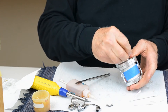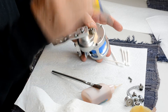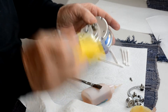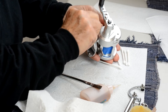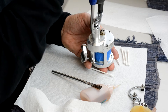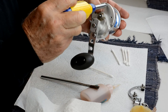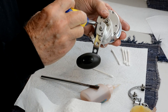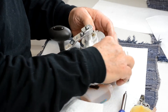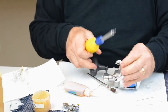The sides all mesh up and you can start putting the screws back together. Take it easy here — get the screws in a little bit and make sure the handle moves smoothly. If not, just loosen it up and turn the handle some more until everything works out. As long as the handle does not bind in any way and the spool doesn't move, you've got it oriented correctly. As I continue to feel it's just great, I'm going to screw in the rest — get them just sort of tight and then go back and torque them a bit. They do not require a lot of torque, but you need to make sure you've got them tight. There's some metal on the bottom of these, so a little bit of grease right here would be in order to make sure that corrosion doesn't give you a problem.